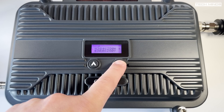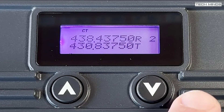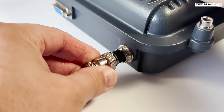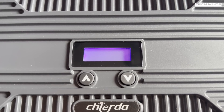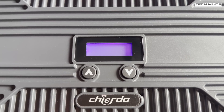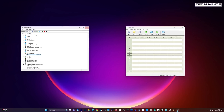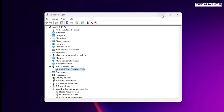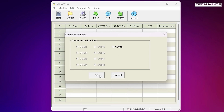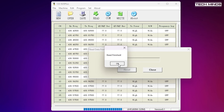Pressing and holding one of the up or down buttons changes the memory selection, and the V9 can store up to 16 different channels set by software. Let's take a look at the programming software to see how we change these memories. The programming cable plugs into the same port as the power supply, but when using it the V9 is powered from your computer — as a result the LCD is blank and only back-illuminated. In device manager we can see the virtual COM port assigned to the programming cable, and within the software we set the COM port accordingly, then click the Read button.